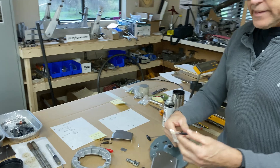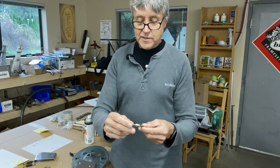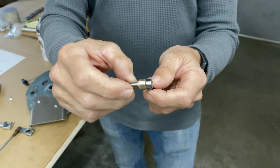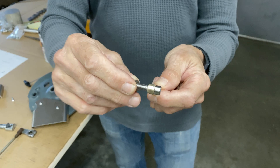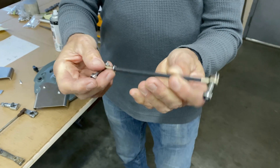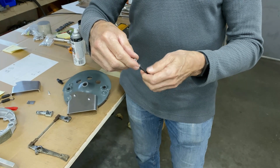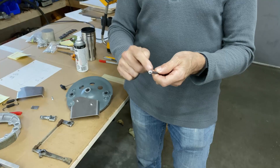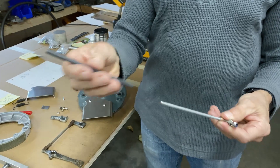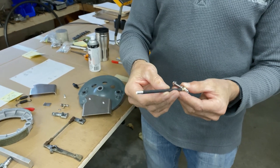I also made up a linkage here. These are little bits of bronze and then I took a stainless steel Allen screw. I had to take a few thou off to match the size of the hole, but that's a pretty nice fit now — maybe a thou clearance. It's adjustable. This is a piece of shrink tube. I didn't want to have to thread a rod on my lathe because this is only basically 3/16ths rod, but I got a piece of shrink tubing that fits over there really nicely. It hides all the threads and it's kind of a dull black. I like that.